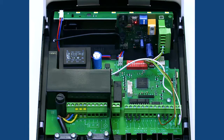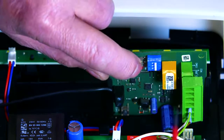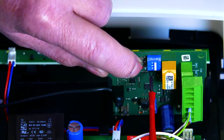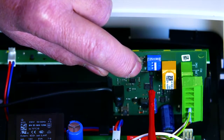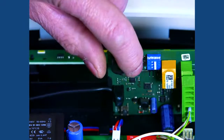If you wanted to delete the safety edge transmitter from the control box — for example if you were replacing it — you need to press and hold down the program button on the receiver. Whilst holding it down, short out the two terminals with the screwdriver. The unit will start to beep slowly followed by a rapid beep. Press and release the program button again. You will hear two beeps. The wireless safety edge receiver is now back to factory setting.